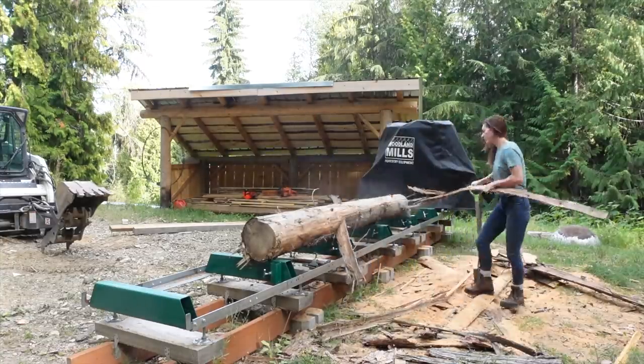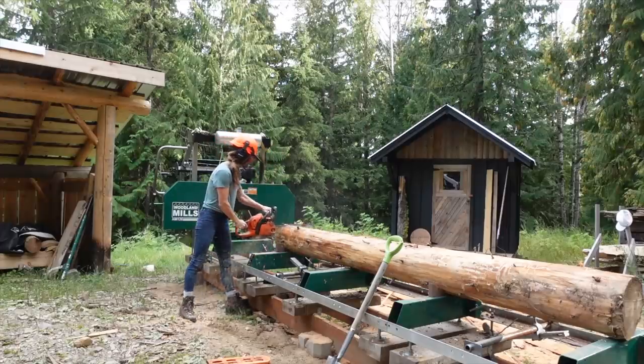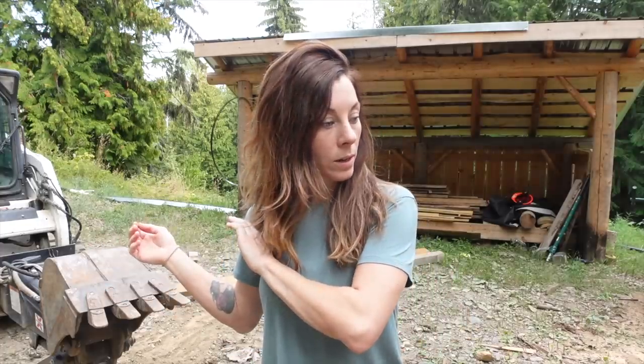The other thing I want to get out of this log is some thicker fascia board, basically. To give my rafter tails a little bit extra length, I was going to add a piece of fascia — a few people had suggested that as well. I think maybe I'll do an inch and a half thick, maybe two inches — I'll see what I can get out of this log. That would give me a little bit extra overhang for my roof. And it's cedar, so that's what I'd want to use for the fascia board. For my rafter tails, I'm just going to leave them square cut because it's simple. All I've got to do is tack on the fascia board and be done with it. So let's get into milling this.